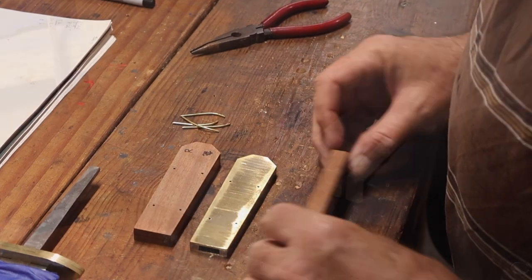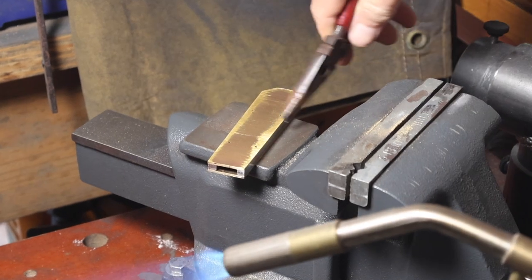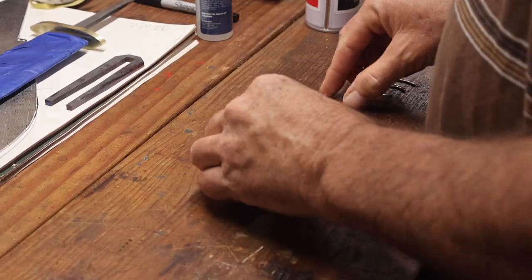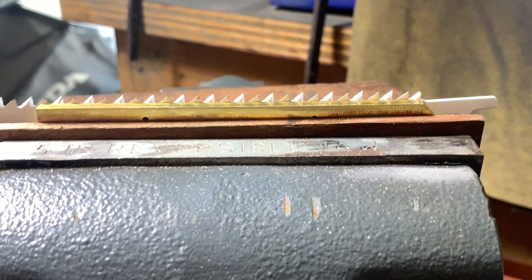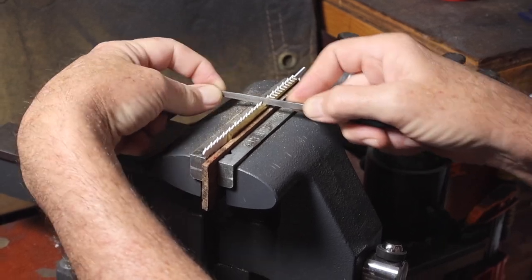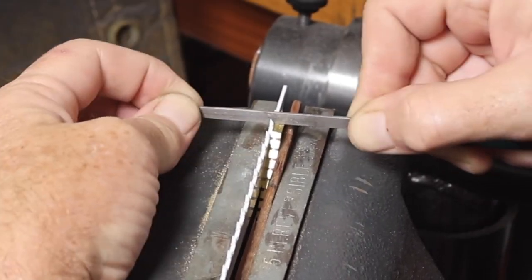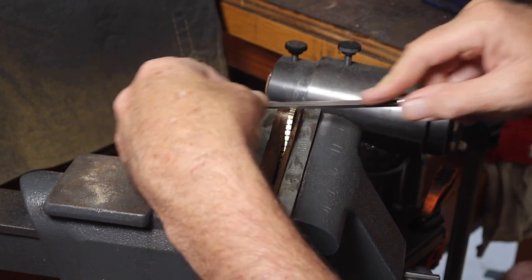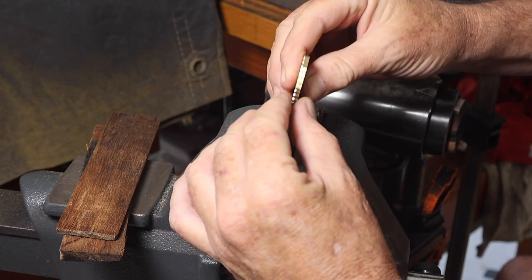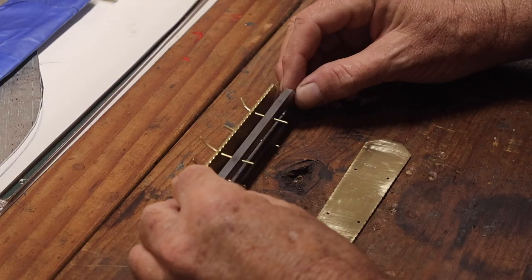Now I'm taking the pins out. I'm heating the liner and frame up with the torch — that releases the CA glue so I can disassemble those pieces. I cleaned all the burned CA glue off and re-glued them back together using the pins as a guide. I'm doing file work on the two brass liners — I want them to be symmetrical. I used a jigsaw blade as a spacing guide to get even file marks down the length of the handle, starting with a straight file and then using a little triangle file to corner around the edges.